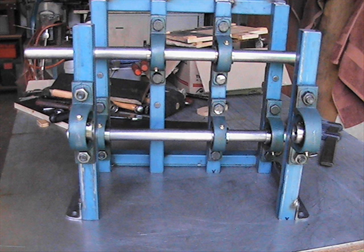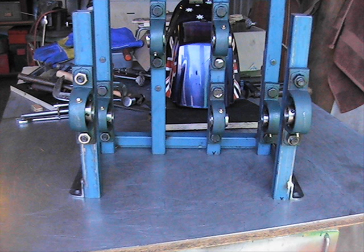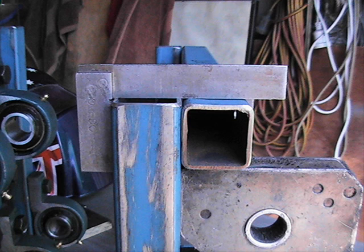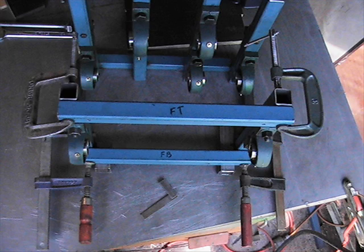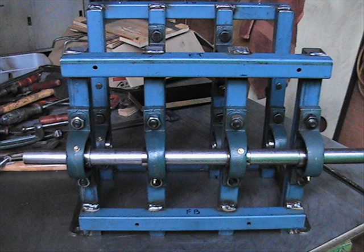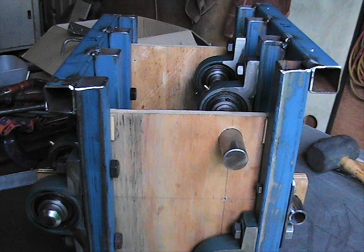Step three: you are now clear to assemble the framing for the front of the transmission. First, remove the shafts from the rear bearing blocks and clamp the two front braces in place, making sure that the holes are facing towards the front. I have used two 35 millimetre pieces of tube to set the height for the front bottom brace. The front top brace is set level with the top of the posts, and make certain that you set your frame square before you weld your joins. Now clamp in place posts 2 and 3, using the same spacer blocks as before, with a 1 inch shaft to align the bearings, with the collars facing away from the center — you are now set to weld these parts in place.